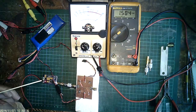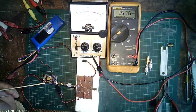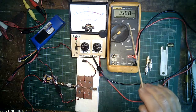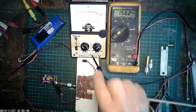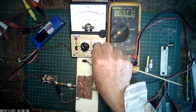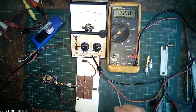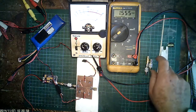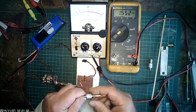These 200 milliwatt VTXs, once you power them on, the RF is high and then it settles back. So we've got a forward voltage of 1.56 volts. I've set the reference for the analog scale. The next step is to use the 50 ohm termination and do the termination test.